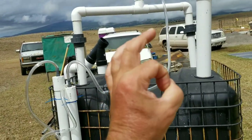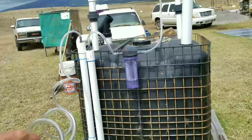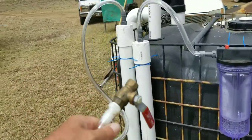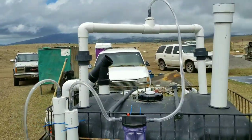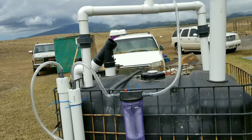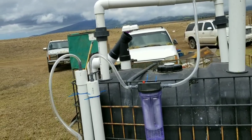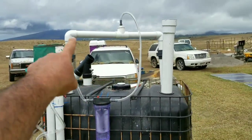What you see here is essentially a biogas filling station. I have a little adapter so I can connect to bags or whatever I'm filling up. This is also how I test whether the gas is flammable. When I opened up the system to do the modifications I bled off all the stored methane, so today is technically the first day it's a closed system again and I'm letting it build back up.